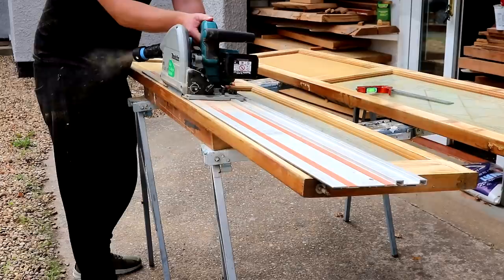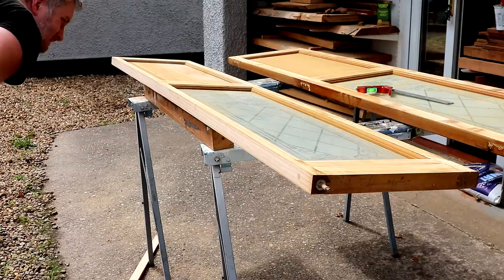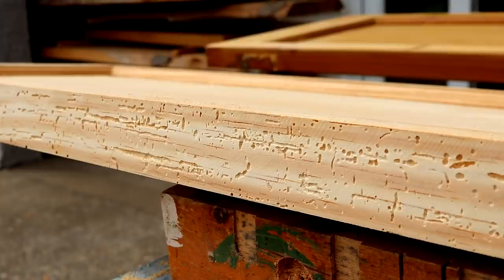I think I'm probably really pushing the limit here in terms of the amount of material that I'm removing from the width of these doors, as the glazed panels really need a decent amount of structural integrity around them. I'm removing about 18mm from each of the stiles on each of the doors, leaving them at only about 24mm wide.